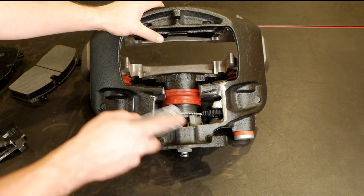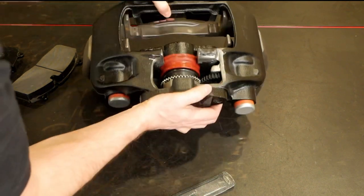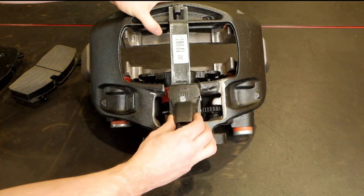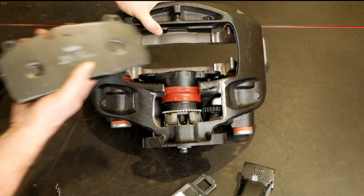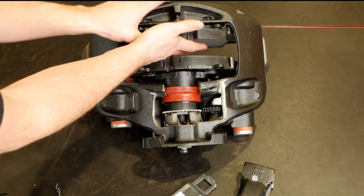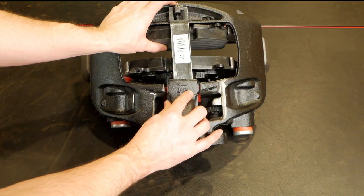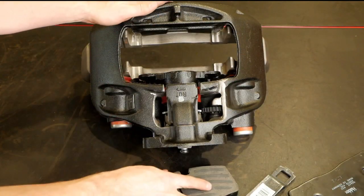This is going to be just as easy to service as the newer Bendix model. Most manufacturers use the same system with a lock tab like this that slips over the top. The piece that was cut away was actually holding the pad retaining strap in place. Ultimately, we drop these brake pads in place and they can be serviced and replaced while the caliper is assembled onto the carrier — simply a matter of pulling off the strap and sliding out the brake pads.